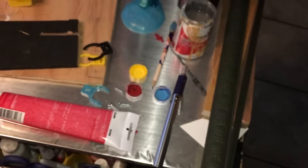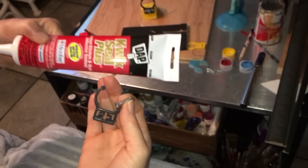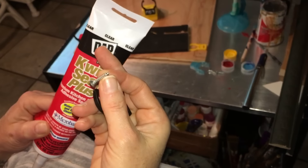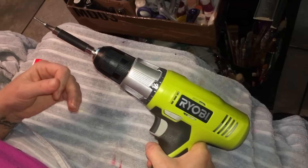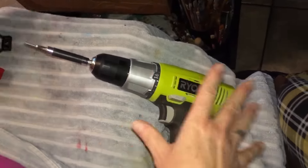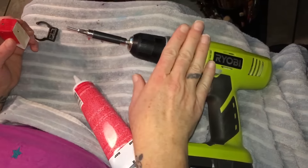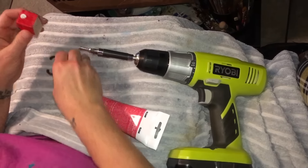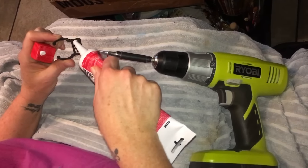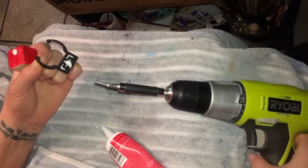I have four already done - I'll do the last one with you slowly so you can rewind it if needed. There's my piece with my pre-drilled hole, I have my clip, my screw, and my quick seal plus clear - I like clear because it goes on and dries clear. I've got my cordless screwdriver - that's definitely a fave, my mother-in-law got that. I stick some caulking in the pre-drilled hole and I have a reason for that.